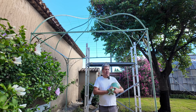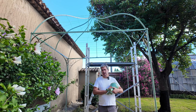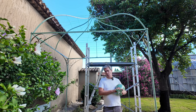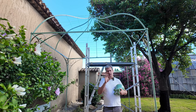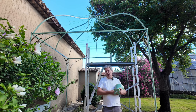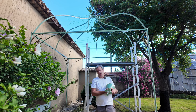I think my initial calculations are we need about 40 kilowatts, which is pretty big. This place is almost like a small mini hotel or an Airbnb kind of thing, because it is so big. We're going back and forth on what we need, what we don't need. So there's just gonna be a bit of time where I'm not online as much, because I've got to calculate all that before I start smashing holes. But the new system, I found this VRV stuff, which is probably more in line with what we need, because we need so many units. It's probably gonna work better.